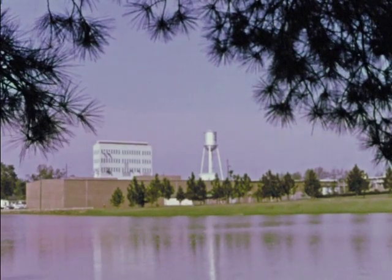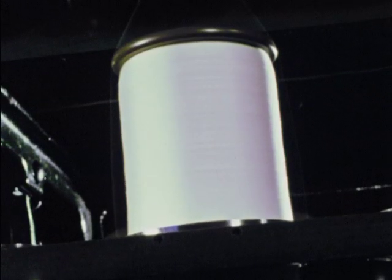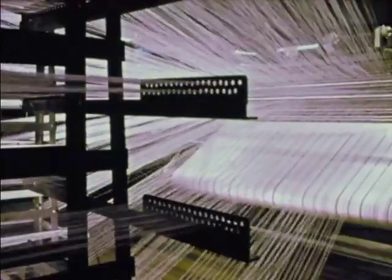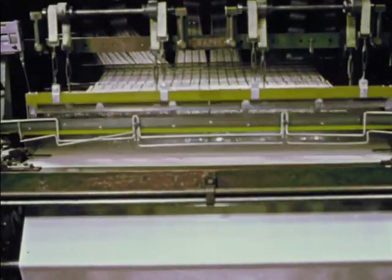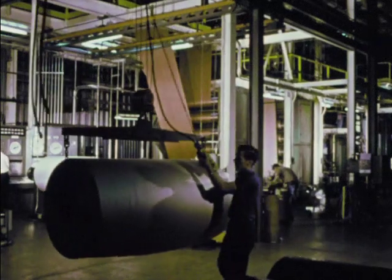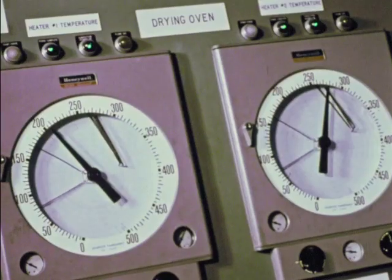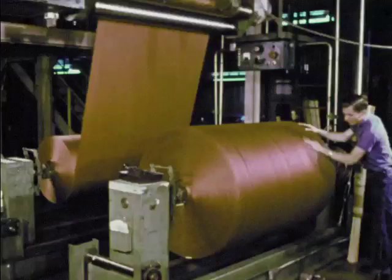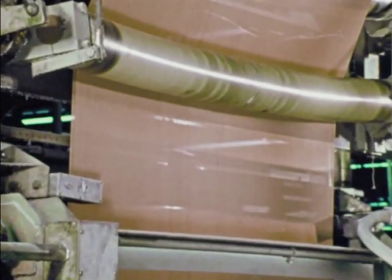This is Aldora, Georgia, where all fabric used in General tires — rayon, nylon, polyester, and fiberglass — is finished and woven to specifications: the right denier, the right number of strands, twisted precisely and woven into tire fabric. Most fabric is then bathed in General's exclusive Gentac dip, which makes the strongest possible bond between rubber and cord — a vital factor. It is all electronic, automatic, complex. Tempered finely in a roller-laden oven, the cord moves to Akron, Waco, Mayfield, Charlotte, and Bryan — ready for use.